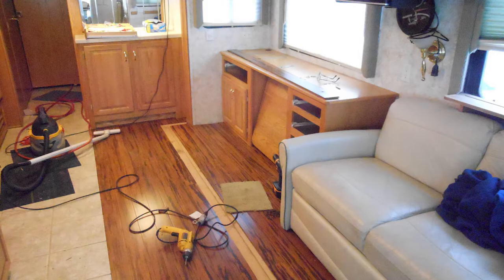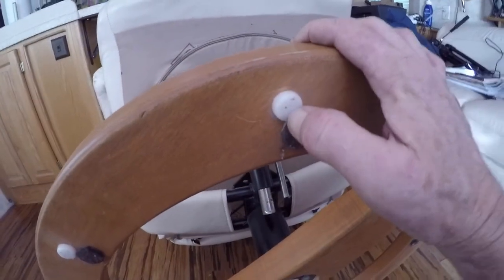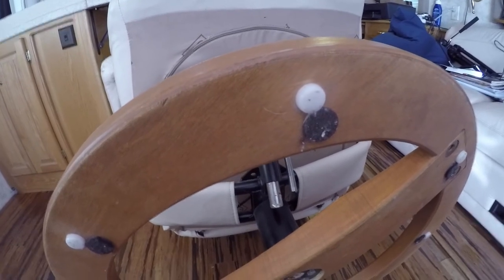Here's pretty much the finished product without the furniture reinstalled. It really turned out nice and looked beautiful when it first went in. I will note that it does scratch a bit — you can see scratches right here. The main culprit is my main chair, which is super comfortable but has hard plastic feet designed for carpet. What happens is dirt and small rocks get embedded in that plastic, and as you slide the chair around it scratches the floor. I added felt pads but they only help somewhat.